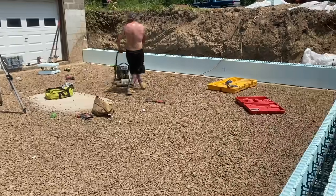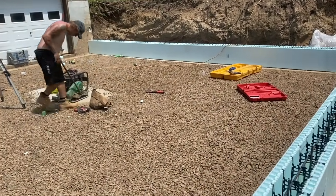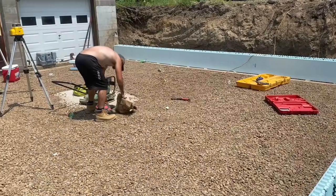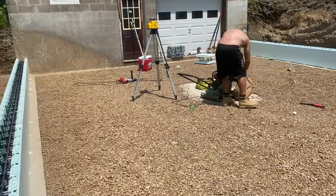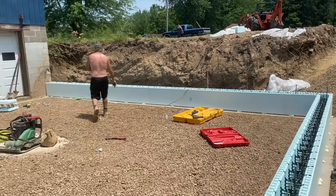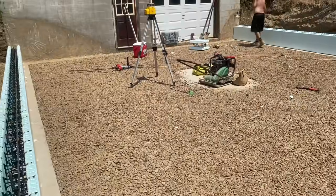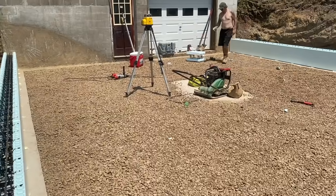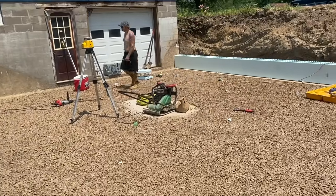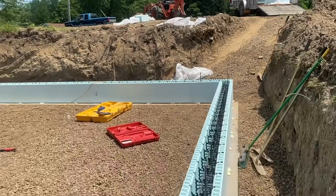And I've said it before, but if you're new to my channel, guys, we like to pour this floor. We're going to pour this floor tomorrow. We're not going to build the walls first because it's just so much easier to pour this floor. We can go right over to the top of the conveyor and pour this whole floor. We can reach over our wall with our mags. We don't have to kneeboard the floor or nothing. And then we'll build our walls after that. It just makes life a lot easier, and that's how we're going to do it.